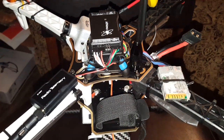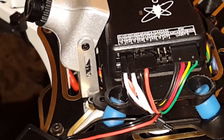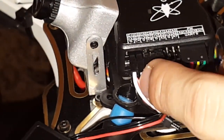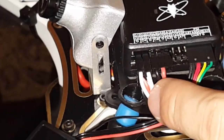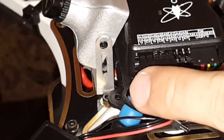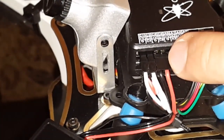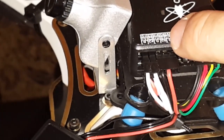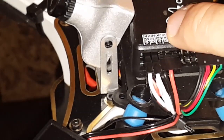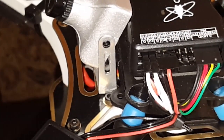We have the channel output. I'll try to include the PDF file. Right here, we see C1 with positive V and ground — that's channel 1, and I have channel 1 giving power to my receiver. Then channels 2, 3, and 4 are all in a row — you have 4 channels with 2 servo leads and no power; it's just straight signal wires. There's also a black and red cable — I ran out of white — with channels 5, 6, 7, and 8. Channel 5 is on the third pin output, which has channel 5, ground, and power. I only have channel 5 and 6 connected, since I already have power on my receiver.